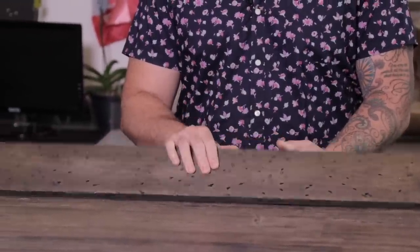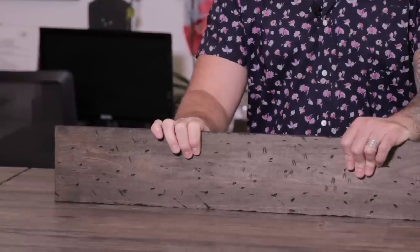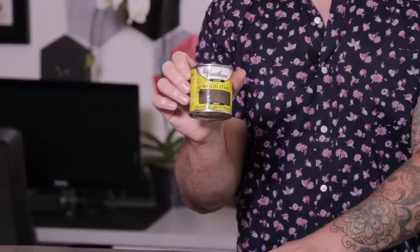I wanted to come up with a structure that we could use on a long farm table, so that's what my inspiration for today was. We're going to start with a 36-inch board, and I've already stained it and battered it. I took my hammer and just beat this wood to death — used the end of it to get these grooves in here, beat the side of it. I wanted this to look like it's been through the mill. Then I stained it with an ebony wood stain just to give it some color. I chose ebony because it'll blend in with any of the other tables being used, and typically they're natural, so this will stand out.